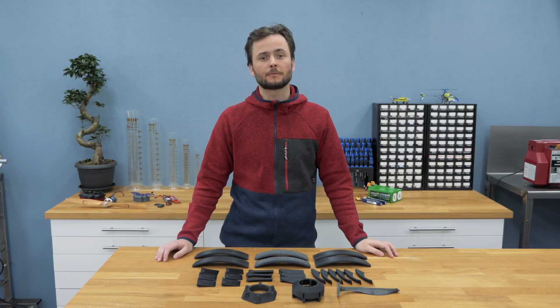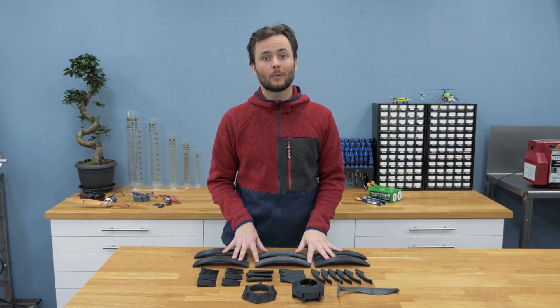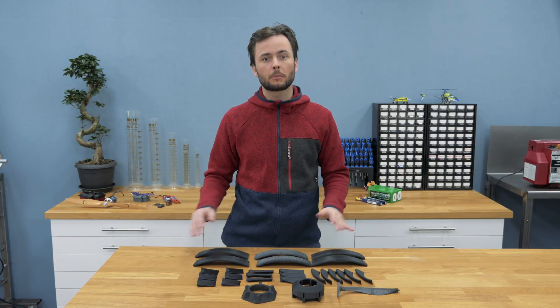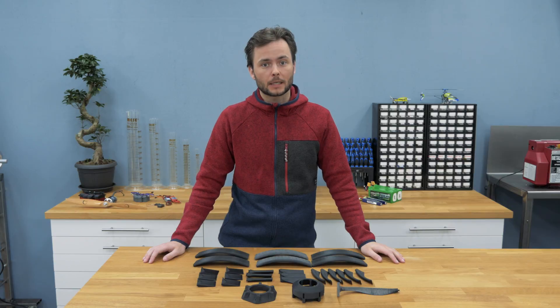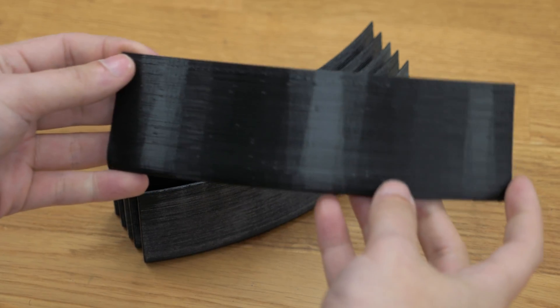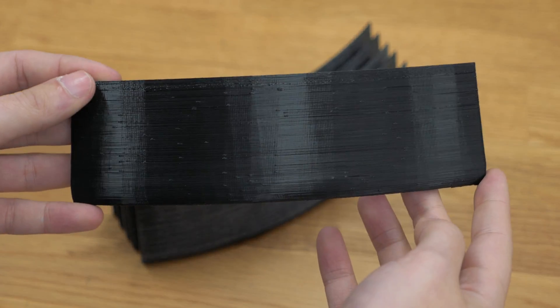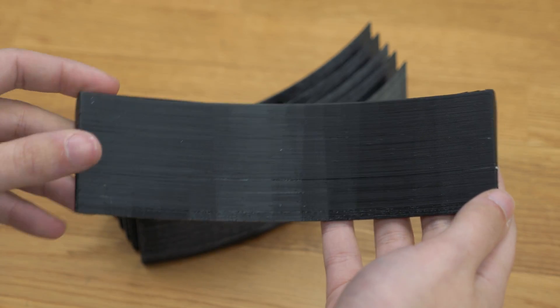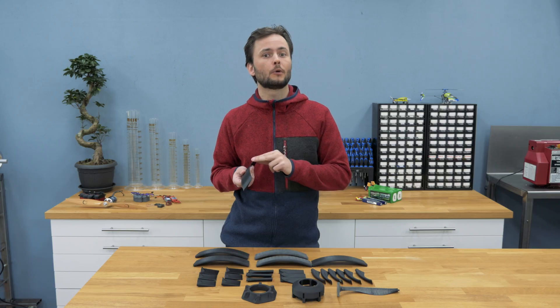Now on to the next part — six parts actually. These six parts together with the cage arms will complete the propeller cage. It has an airfoil shape, but this is not because I want it to generate lift, but simply to get it stronger. The thicker part here in the front allows me to have a solid connection to the center hub, and the trailing edge is thin just to allow a smooth air flow.